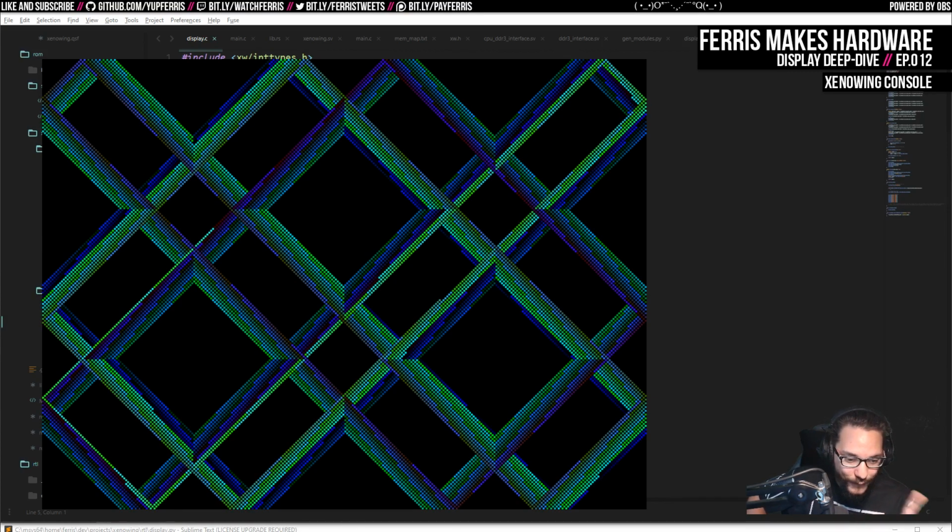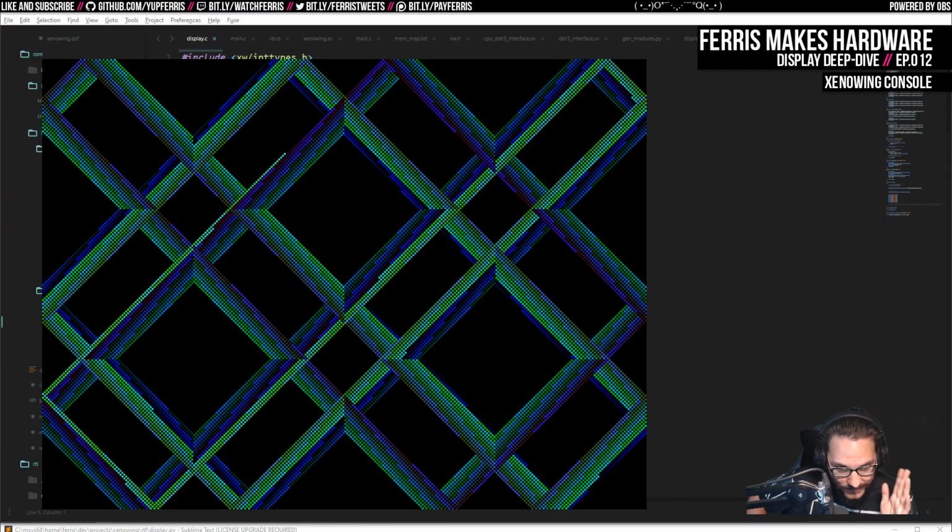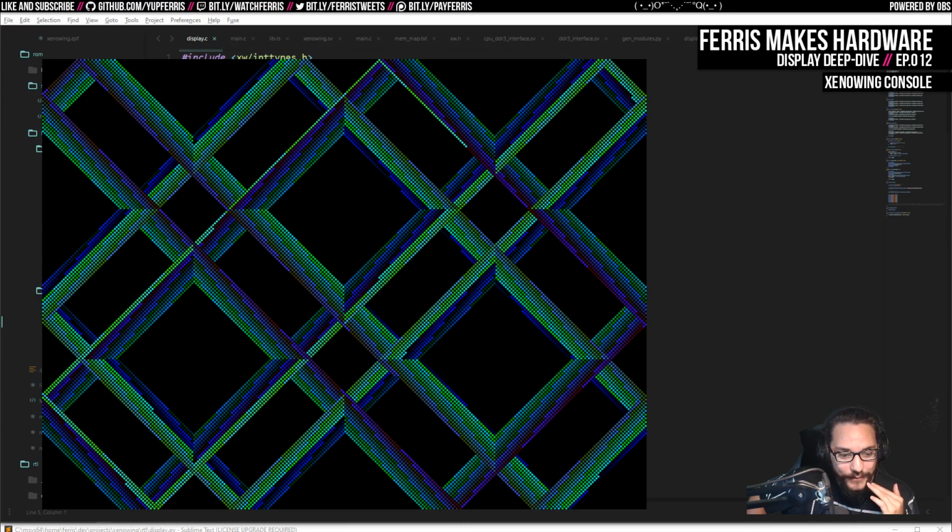So if I started 4 pixels early, then I could essentially read all of the pixel data as we go along, and display it kind of on the fly. And I don't think that's a bad scheme. The problem is I did the math for how long the bus would be blocked every frame, and it actually turns out we'd be blocking the bus for about 75% of the frame, which means the CPU couldn't access it at all, which would be really, really bad.